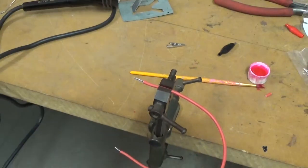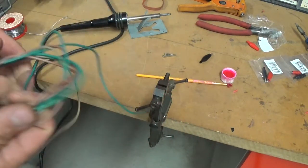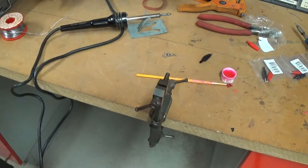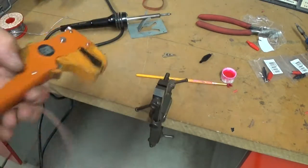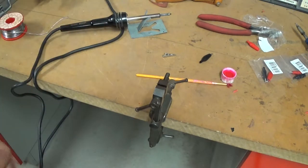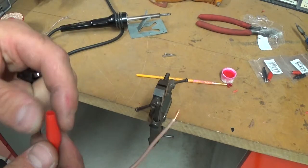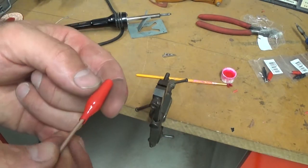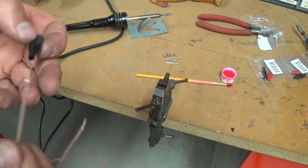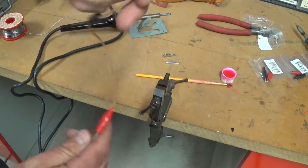Okay, so that's the general idea. Let's set up and do some actual wiring on our test leads. This wire was stripped from an appliance lead. I'll take the ends off — I don't really care how long they are, just use the whole piece. One thing I should have done is put the insulation covers on first before I cut them, but they're going on all right. One on either end — I'll take the alligator clip out, push this on, and push the insulation covers into the center to get them out of the way.